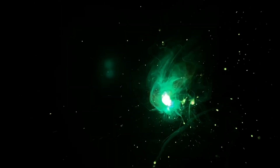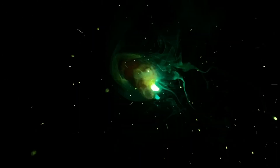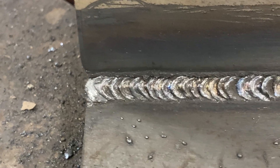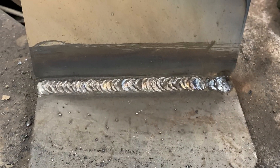You'll notice here there's a lot of sparks going on. What you want to try to do is keep a really tight arc, and that will eliminate a lot of the sparks and focus most of the arc into that puddle. Here's that first pass — what we kind of want to end up with.